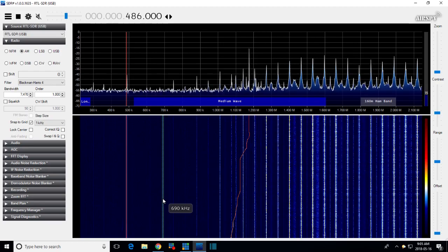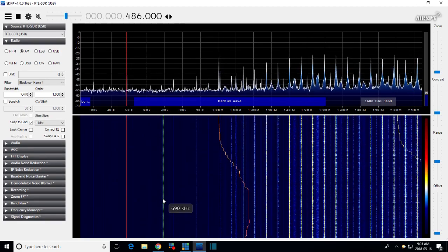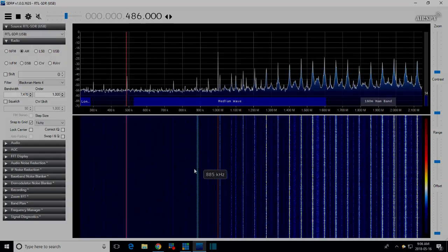So let's set it to a particular frequency. This is the best way to do this. We set the local oscillator to 1,000,000 hertz, because my arithmetic is so poor. We get it set to 1,000,000, and the math all becomes easy. So we have a 460 kilohertz IF. The local oscillator is designed to run 460 kilohertz above the signal you're actually trying to receive. So subtract 460 from 1,000 kilohertz, and we get 540. Wow, right at the bottom of the AM band, 540. Now, is that really true? Here comes the moment of truth.